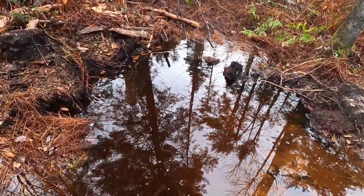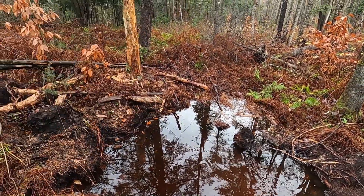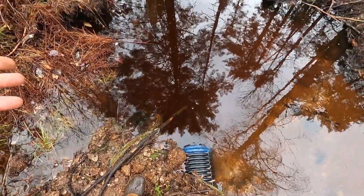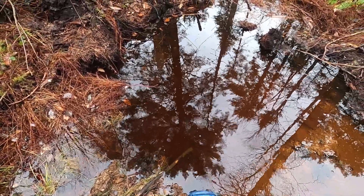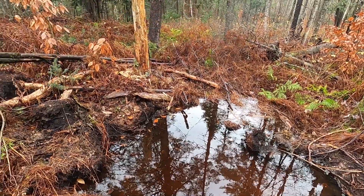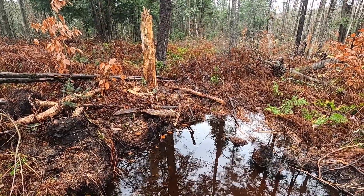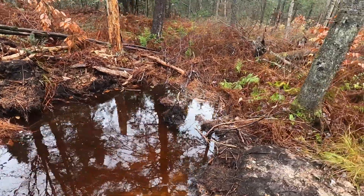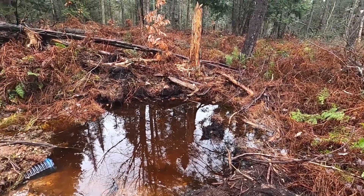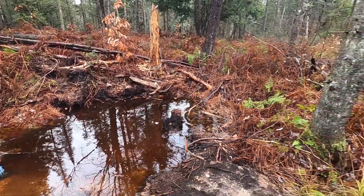On the outlet side there's not much of a drop off. If I remove some of that debris, it will drain fairly well. The dissipator pad for this culvert exit is just pure flat bedrock — ledge. You can see some of the material leaving right there. I think that's the path I'll clean out, and if I have a chance with the excavator before winter I'll bring it up here and take care of that. I'll allow a little bit of a retention area so the sediment settles out, but out this far from the stream it's going to end up in — I'm not too concerned about the sediment.